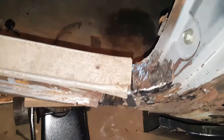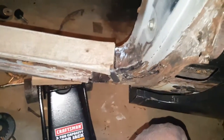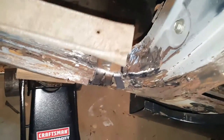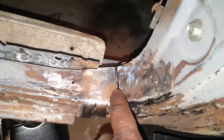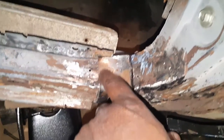Like I said, I don't really know what I'm doing with the butt weld, and I don't want to be riding down the highway at 60 miles per hour and have the rocker pop loose. So I think I'm just gonna lap weld that, give it a lot of strength. Probably punch some holes right here and there, plug weld in there.